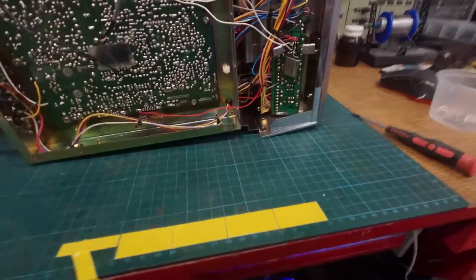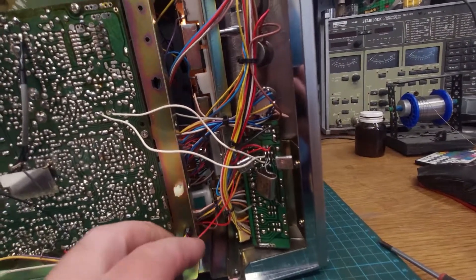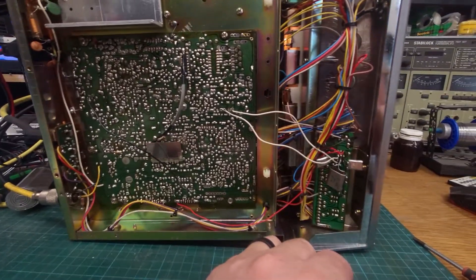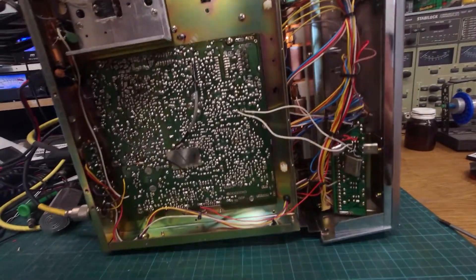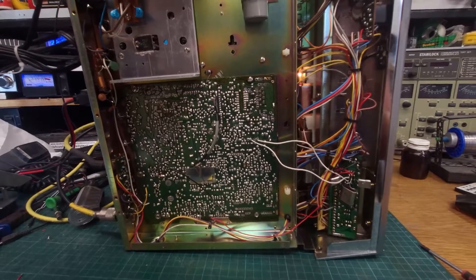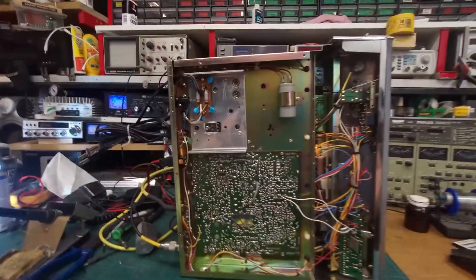The radio is very clean inside, I'll give it that. Wires coming from here to our speaker switch — this is where our half-baked conversion is done. You can see it there: it's a crystal switch arrangement, so you know that was the way things were done 40 years or more ago. We'll get ready to undo all that nastiness and put in one of his conversion boards, and it'll give us low, high, plus 10kc, which is all you need.